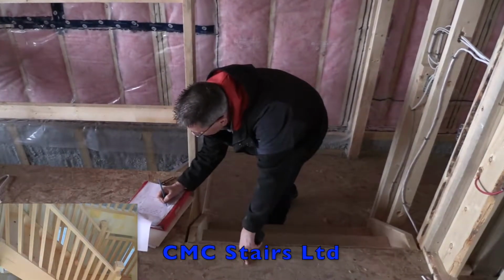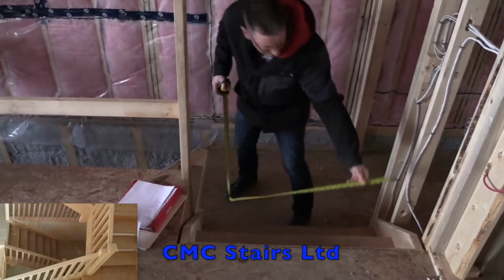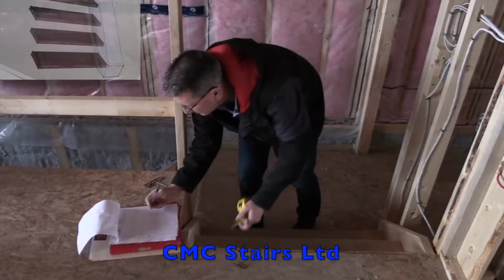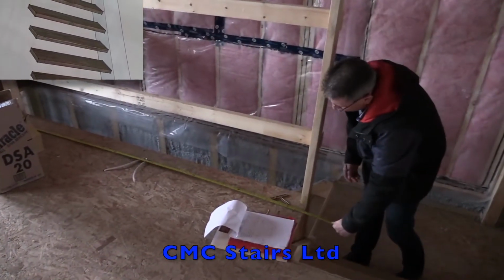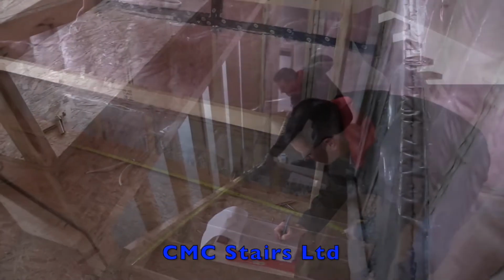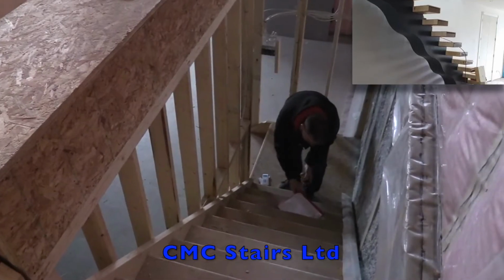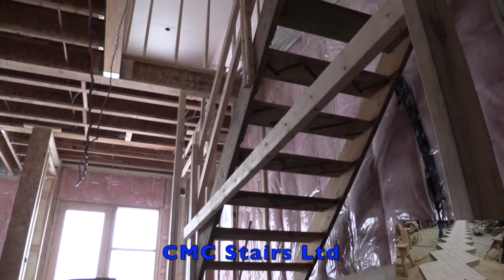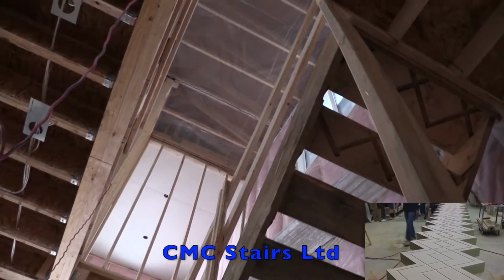So by me just simply using solid capping around the frames of my stairs, that can take a beating, and it can be sanded out and touched up without having to lay new wood in place of the damage. So a lot more reliable, a lot more stable. In our current climate where our humidity changes drastically, contact cement doesn't hold up in the sunlight. And a lot of these stairs, they're surrounded by windows and tall walls, and look at how open my home is. So I think it's important to have a product that I don't necessarily have to come back and service because I built it right the first time.